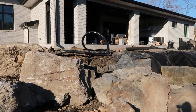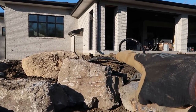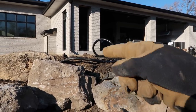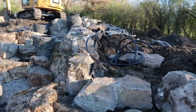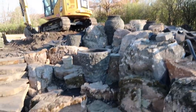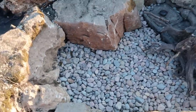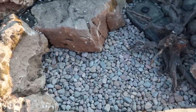I wanted to make sure that we left enough space between the pond and rock work inside the wetland filter there and the main part of the pond. I wanted to have a landscape buffer between these rocks and the water feature up top to be able to soften all that. We ended up buttoning up the whole reservoir area, which has geotextile fabric or a geogrid over the top of the aqua blocks, and then we put the gravel on top of that.